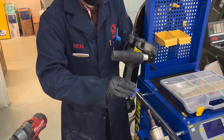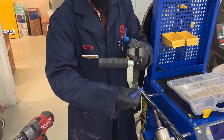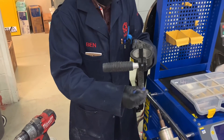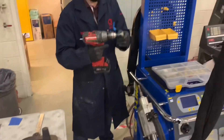Also, if you have a machine that's water cooled, if you remove too much material, water could come out of those tips unintentionally during the welding process. Lastly, outside of using sandpaper or the manual tip cleaner, we can use the tip dressing tool in the drill, as seen here.